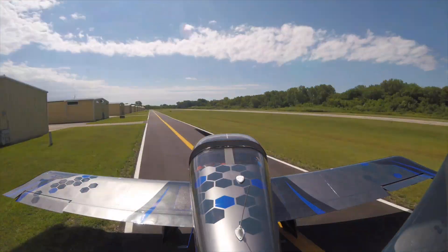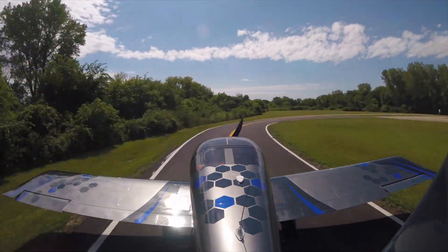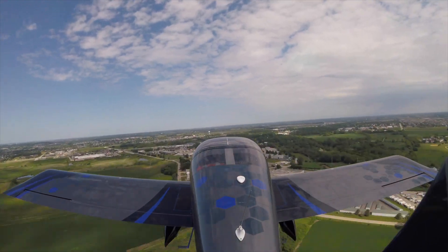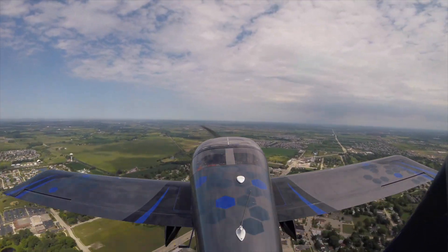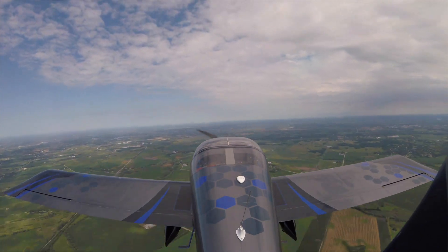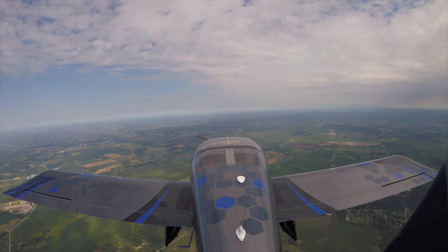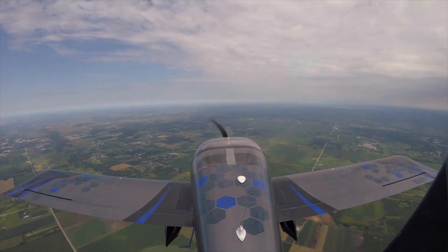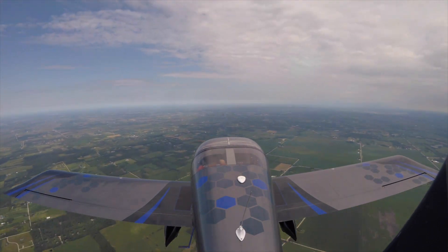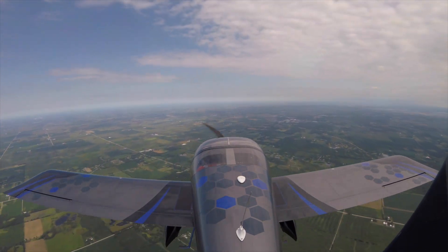So I'm replacing the GDL with a 50 or a 52. The difference is the 50 is only ADS-B in. The 52 is ADS-B in plus XM weather. The box is the same size, the same mounting. It uses a DB15 connector instead of a DB9, so no big deal. It gives you an extra serial port, which is nice in these airplanes. But other than that, it should be pretty much exactly the same — a slightly newer unit.